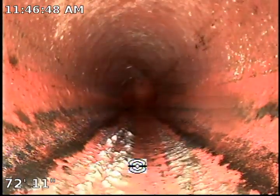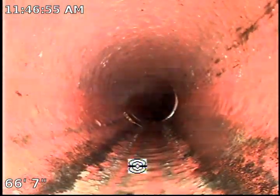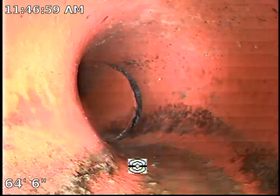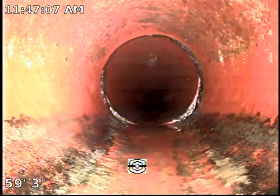It is recommended to check the records and see if the sewer mainline has ever been hydro-jetted or if there are any known tree root issues. As you can see, there are multiple turns in the mainline that restrict the actual camera rod from pushing further than 95 feet.